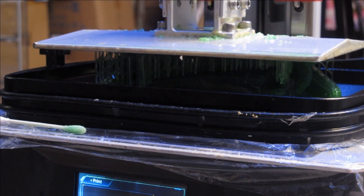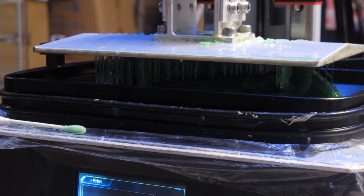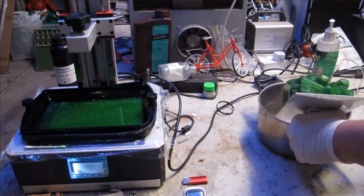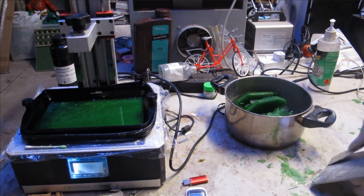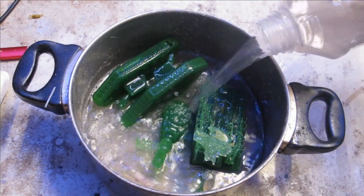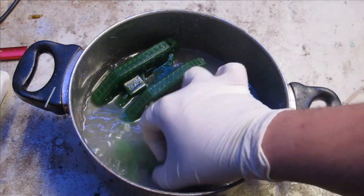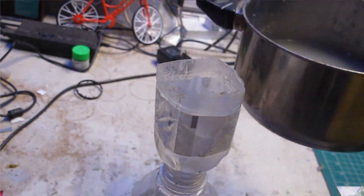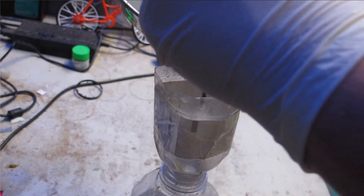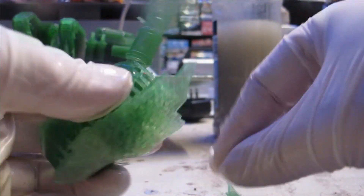In the past with very good resins I would actually struggle and it would peel or fall off the bed, but with correct heat it's been pretty good. This resin did not fail in any of these tests, but I did find this resin to be semi-transparent and very brittle. It took a little convincing to get it off the plate and the supports started cracking and disintegrating. It was promptly washed in isopropyl alcohol and all chemicals are reclaimed for future use. The model was allowed to cure under natural sunlight for a few hours.